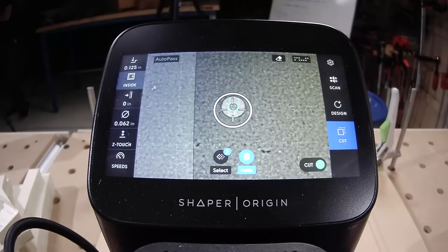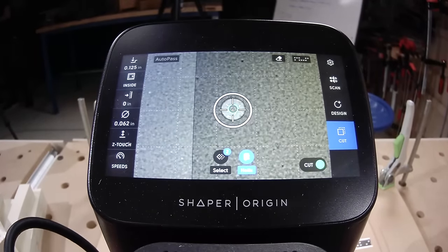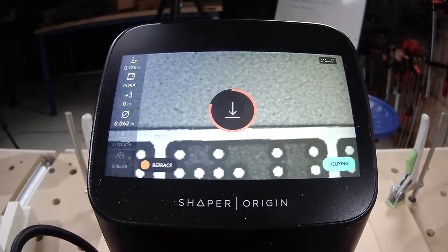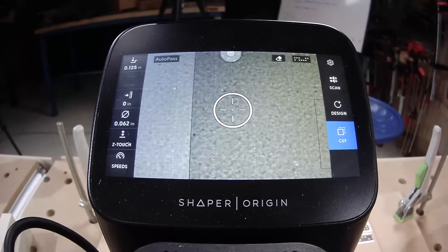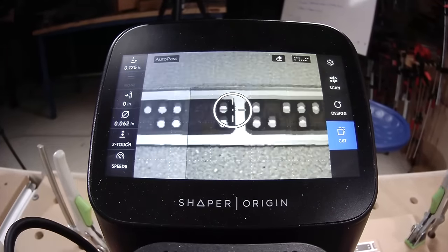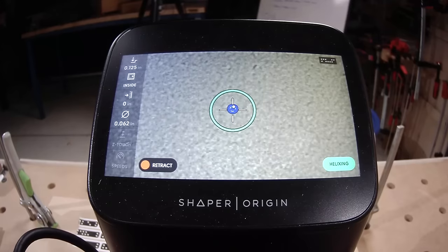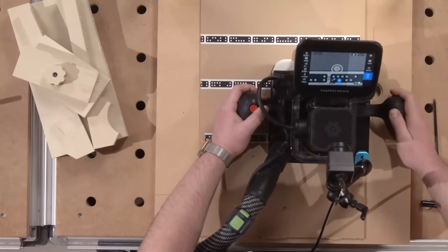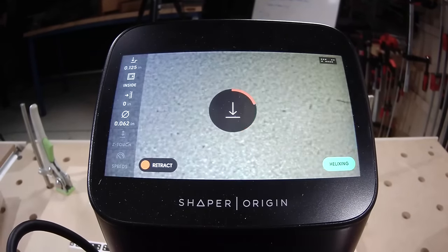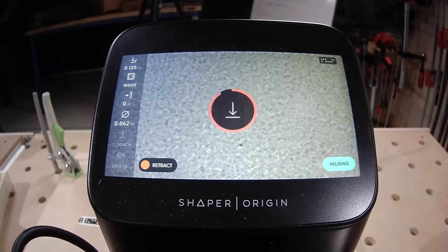One of our most asked questions answered: what's going on if I don't see that cut path? The answer most likely is that your router bit is too big for the path somewhere. The cool thing about Origin is that it automatically calculates all that for you, so it prevents you from making mistakes. We fixed that in this case with the sixteenth-inch router bit. Jake is helixing these out — Origin is kind of our favorite drill press in the shop, because for zipping out holes of a strange size in just the right place, you really can't beat it. These are clearance holes for number four wood screws. After we cut all these clearance holes, we're coming back with a 90-degree engraving bit to cut the countersinks.